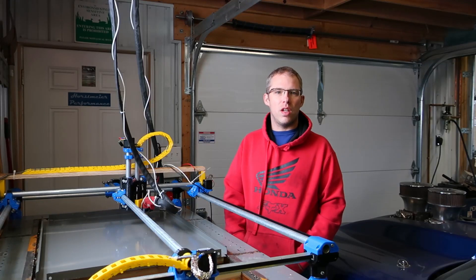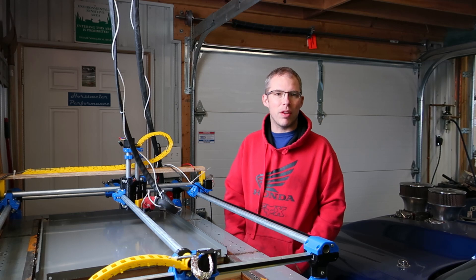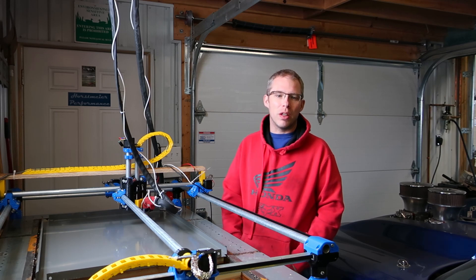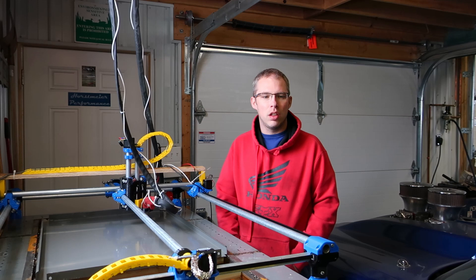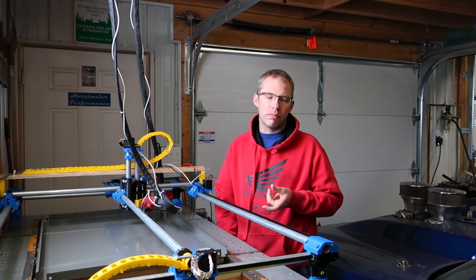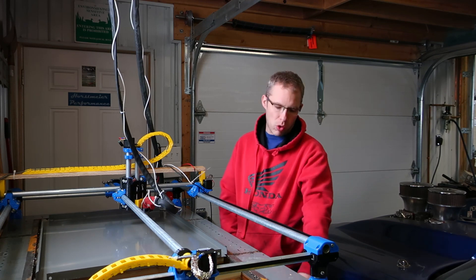Welcome back to Eli Works. Today we're going to try and see if we can alleviate the problems we're having with the Arduino shutting off. We tried in the last video, but that one was getting awfully long. Hopefully I have a relay showing up today, and we're going to replace the small Arduino 5-volt relay with a solid state relay that I can place further away from the control unit.